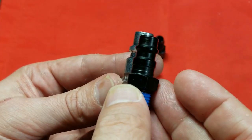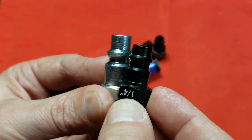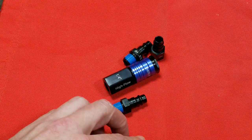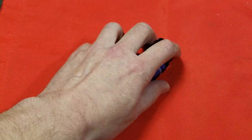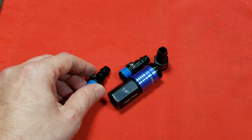We can see that these are significantly not as big around at all — the nose is shorter. So they're not 3/8" fittings either. They really are their own proprietary standard. And people are kind of just being taken for a bit of a ride getting a new proprietary set of air fittings because they're not going to be compatible with anything else.